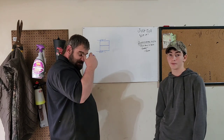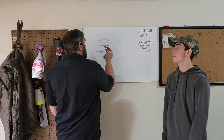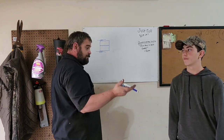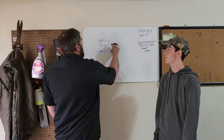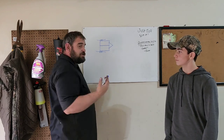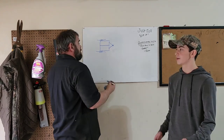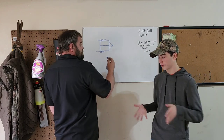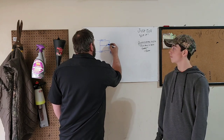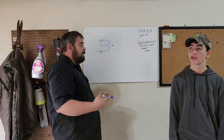Yeah, we can just use the same type of springs, and we'll drill holes in them to be able to use the bolts and go right through the spring right to the plate with using the leaf springs with no problem. And then we'll bring a bar down from here and a bar down from here, just like a trailer, for a central pivot point on the frame. So we can move around and do all these cool adjustable thingies with the leaf springs, and then we'll put the engine plate on the square, that way the engine moves with the axle with no problem.